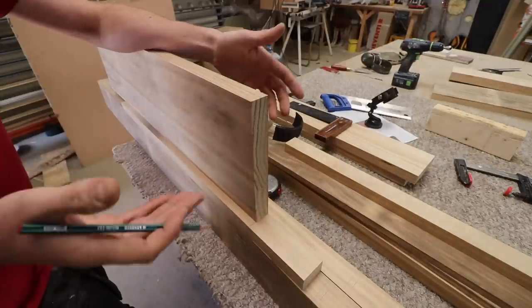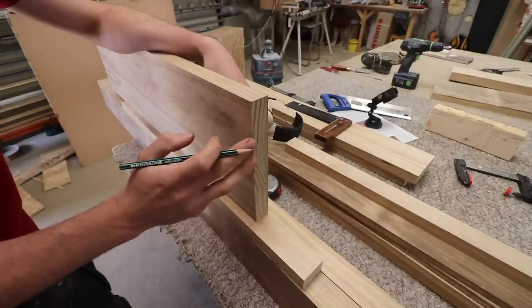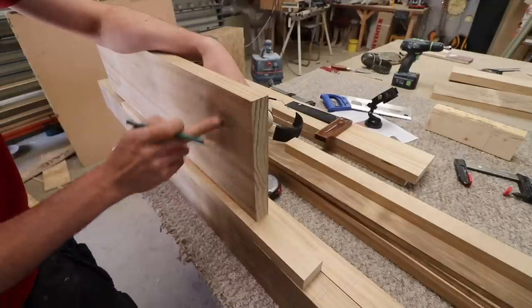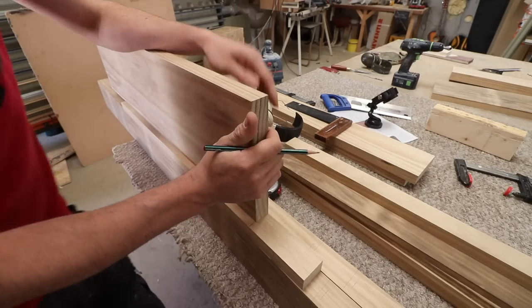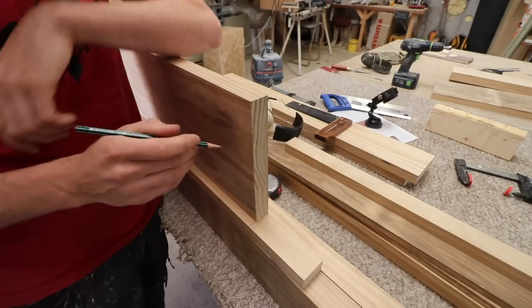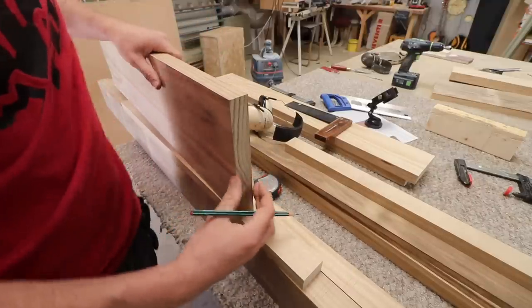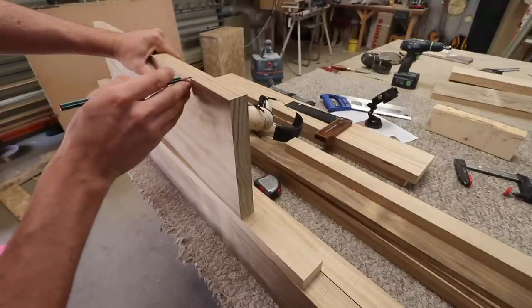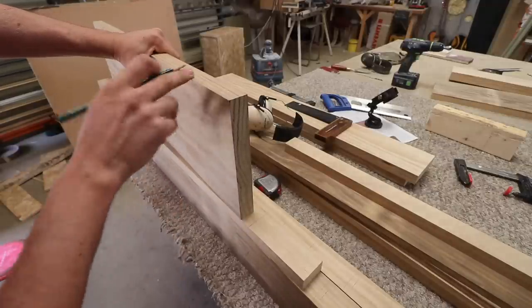And it also leaves you at the hands of the accuracy of your machinery. So this bottom cutter block has got to be perfectly in line with this face here to form that thickness of tenon that you require. And it can be a bit of a pain to set up. So what I normally do, especially on the thicker doors, if you're doing a 2 1/4 thick door, is have the tenon so that it cuts a small cheek on this side as well, so that you've got a tiny little shoulder there for it to work to.